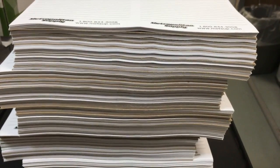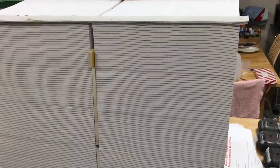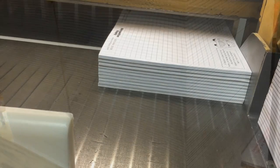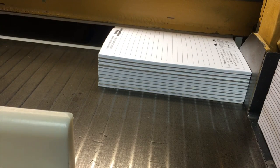These 4-up pads are then cut down into 2-ups and then they're stacked nice and neat. A liquid padding compound is applied — that dries in a couple hours. Then those pads are sliced apart so that they're 2-up pads, and the 2-up pads are then inserted into the paper cutter and cut in half.